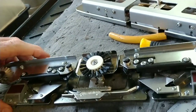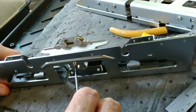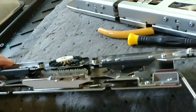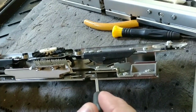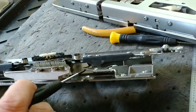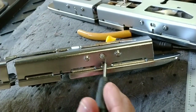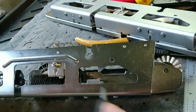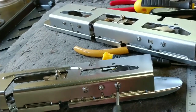We've been looking at the way the lace carriage works and realizing there are a lot of rather flexible parts, which leads us to believe that one jam — from choosing the wrong yarn or getting a snarl in it — could cause it to fall out of adjustment. Yes, it's one of those things that if it works fine and doesn't have any problems knitting, it'll stay pretty much like it is, and a little silicone makes everything slide better. But yes, this will flex and get out of adjustment, and you can pull them out of adjustment just as easily as you can loosen them, put them in, and tighten them back up again. Dropping would probably do it too, and shipping could do it.